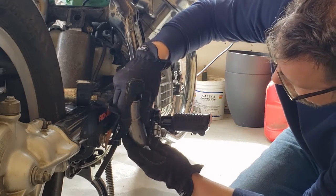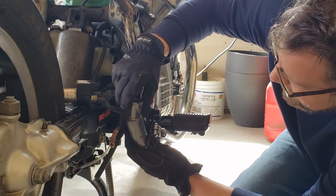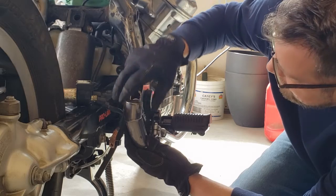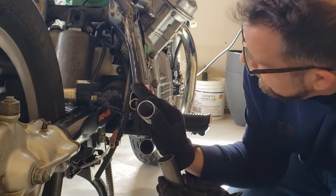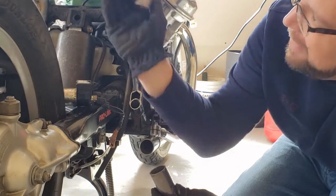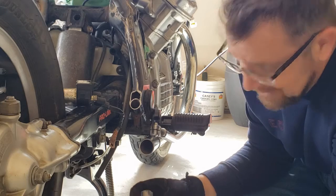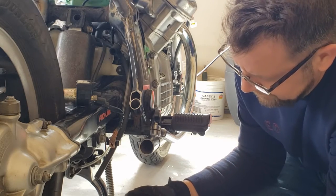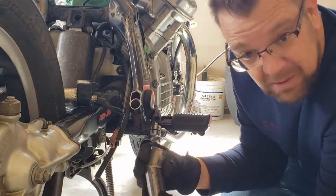Line them up so that my angles don't start twisting in and out like this. I do have a slight twist I need to do to kind of match how I want this to go. You know, it's coming out and it's going to lay in, it's going to go up, and then I want to twist back out to follow this trajectory of how I have the seat laid out. But I know that, and if I wasn't doing that, if I just wanted to keep it right, that weld seam is a perfect guide.